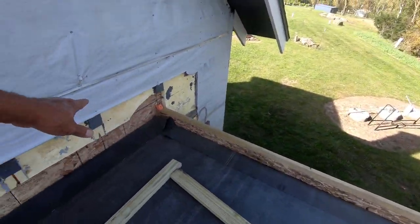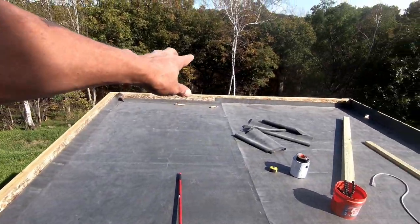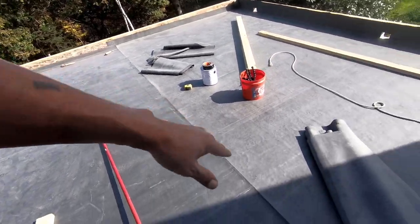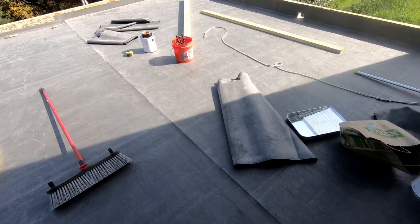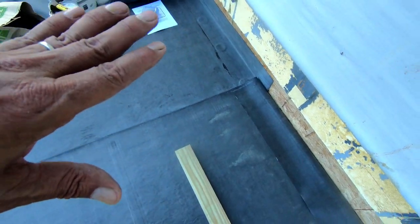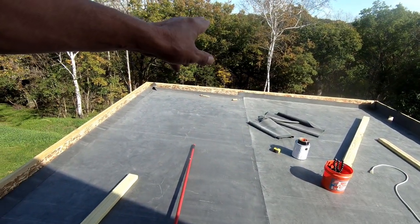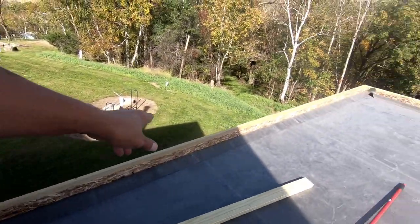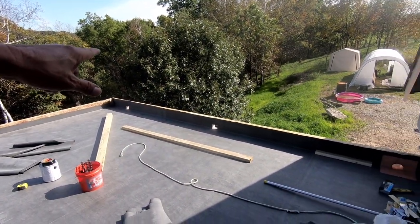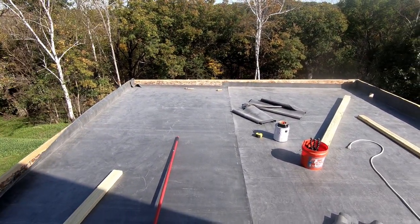I have all three of my reinforcing strips glued to the membrane. You can see that the stuff that goes up onto the parapet is folded over — that allows me to fold this seam back and do the seam. I guess I'm going to do it right up to where it hits the parapet, and then it'll look just like it does right now. Then I'll do both of these short walls that overlap with multipurpose adhesive, and I'm going to do this one with latex. I really got to get going — I still have two more scuppers to put in and I have to do the strips on them, so I really need to get moving.